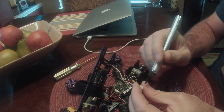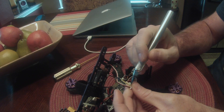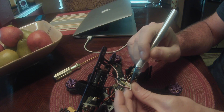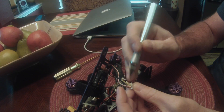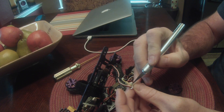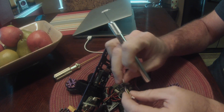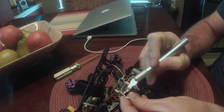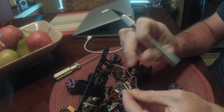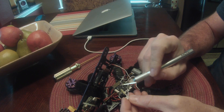What you're going to want to do is flip the little tabs up — I use an exacto knife and just get underneath the little white tab, pull that up, hold it, and then slip the wires out. You'll need needle nose pliers to grab onto the little cut ends, pop those tabs up, and pull them out on pins five and six. So this is one, two, three, skip four, then five and six — pull those out and take the wire coming from the smart port and daisy chain two wires off of that to go into five and six.